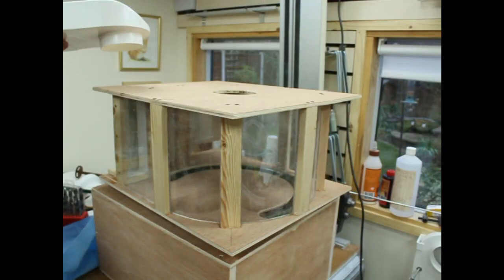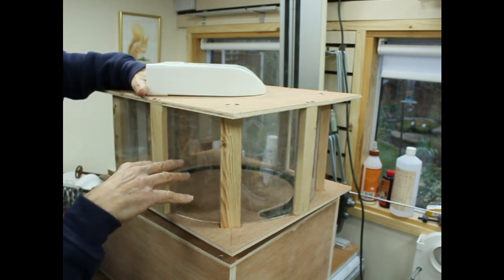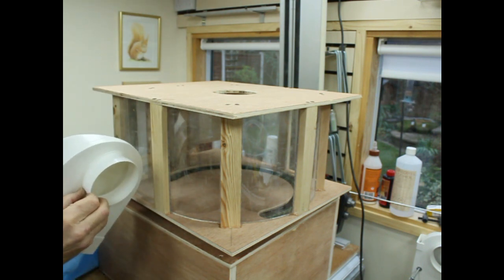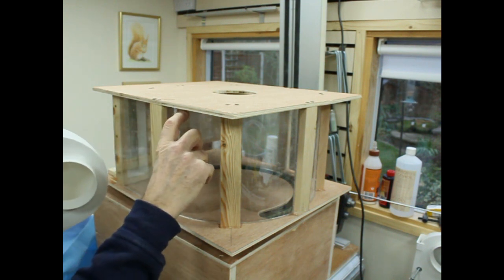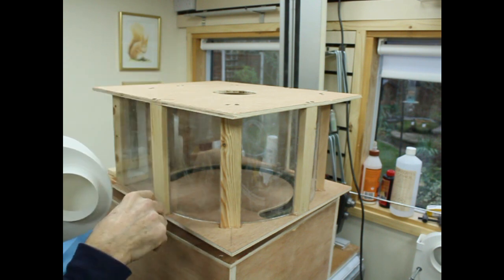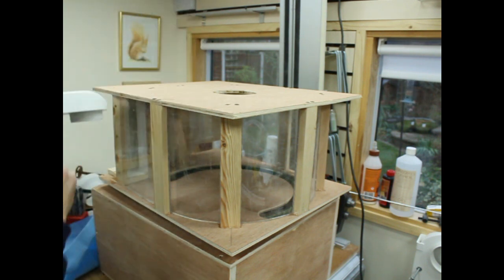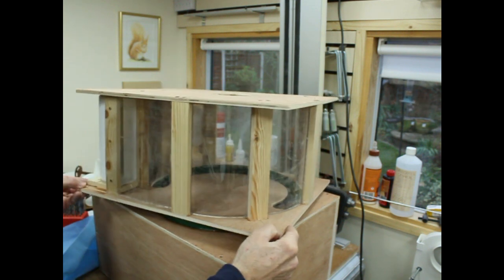The only thing I've got to establish is the depth of the tube which goes down inside the cyclone itself, which is the extract up to the vacuum cleaner. That is not long enough, I don't believe. I think it needs to be at least halfway down into the cyclone itself, and that's only going down about an inch. So I need some 4-inch pipe just to extend that down in there. But other than that, that's now ready to go.